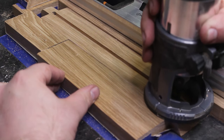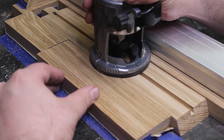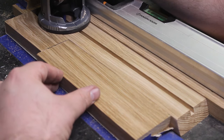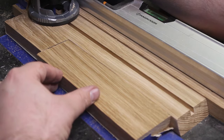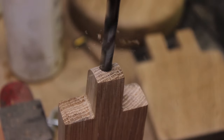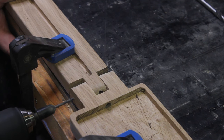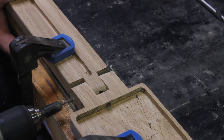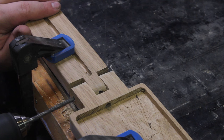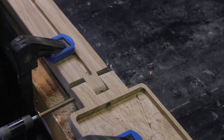I perhaps should have done this before all of the sanding, but the next stage was to route out a channel for the cable to run down the main upright of the lamp. I've just used some bits of wood taped to my bench to give me a guide for that. Following that, I then drill a hole in the end for the cable to pass through between the channel and the head of the lamp. Having clamped the two pieces down to the bench, I used a pilot bit to start a hole through the finger joint, then came back with a larger bit to make it the right size for the pin I'm going to use to attach the hinge.